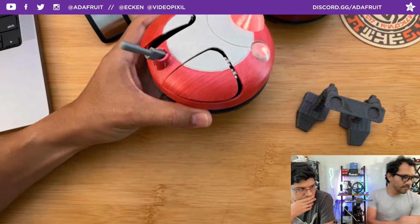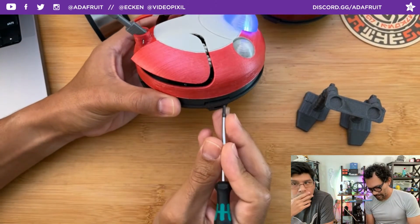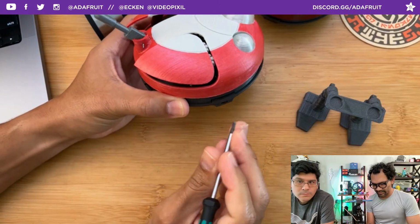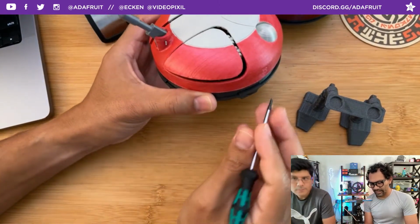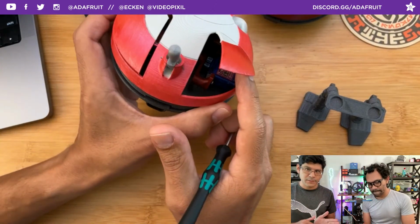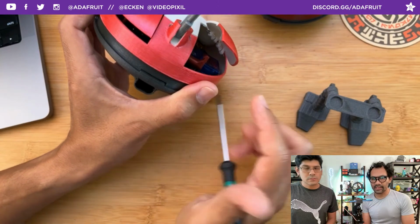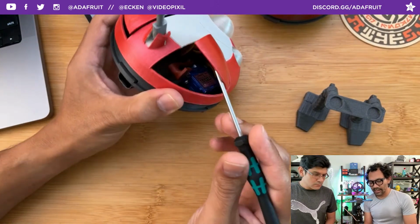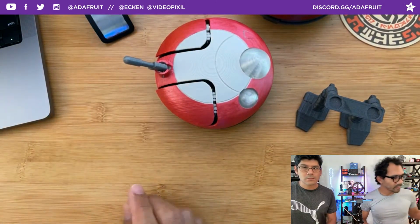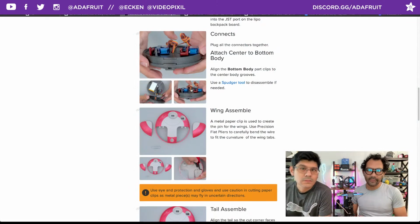I think I just popped my slide switch in. There you go. So when you turn it on, that's where it resets. It'll go back to reset at 7 degrees, and that's where you can position your servo horn. That'll be the starting position, and that's how you can sort of sync or calibrate them.